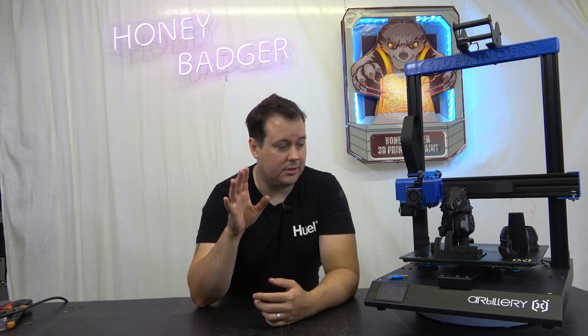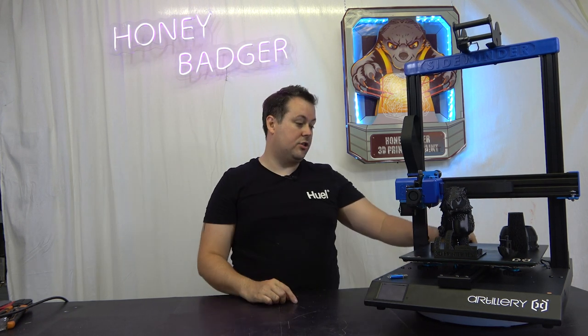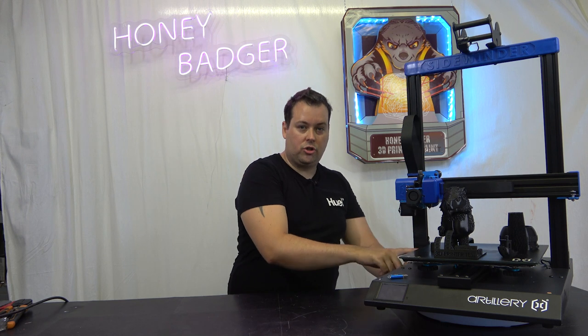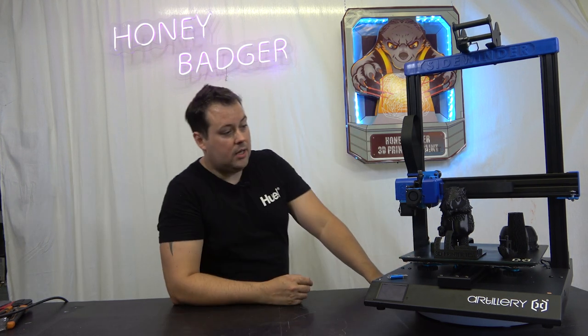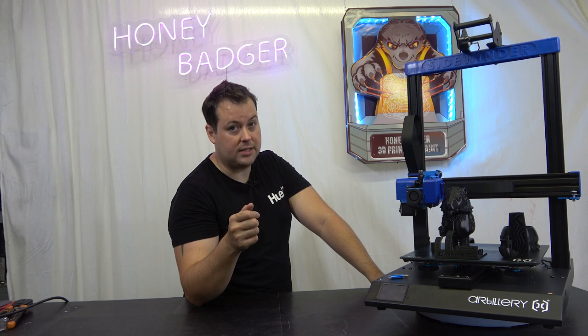As you can see, they've fixed everything bar one issue — they have left the plastic idler arm. To be clear, it's a relatively minor change to make, it's easy to dismantle the tool head and very cheap to swap over, but it is a little disappointing we didn't see an all-metal idler arm. Running down the improvements: they've wildly improved the bed with a strain relief and a channel cut at the back. There are now braces and clips on every single flat cable. The cable now docks as part of the assembly procedure. We have a BL Touch sensor. And we've switched to a 32-bit mainboard that no longer requires you to unplug the TFT to flash the firmware.